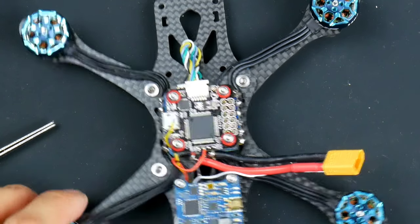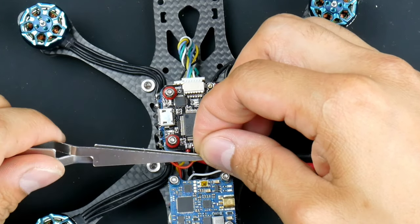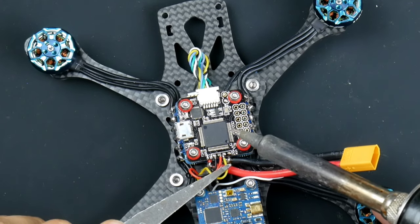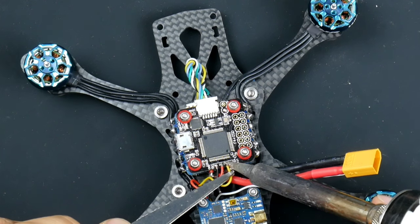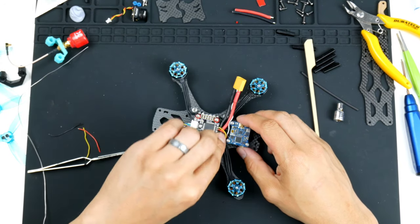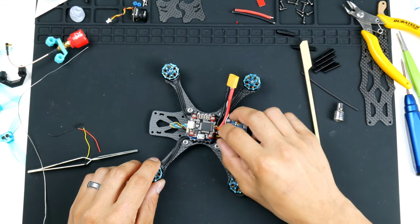I should be wiring up the video out to the video transmitter instead, not the video in. So the next one is the video out, right next to the 5 volt, and it's going into the video transmitter. So, see if we can get it in there. And there we go. All right. So, just tuck these in here. Shouldn't be a problem there. Okay, cool.